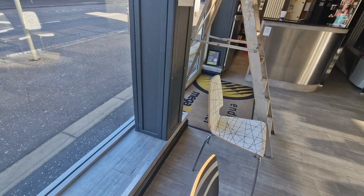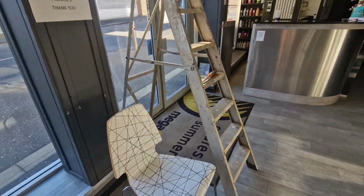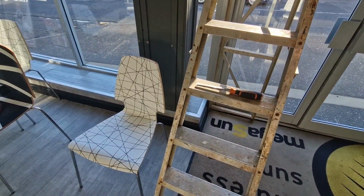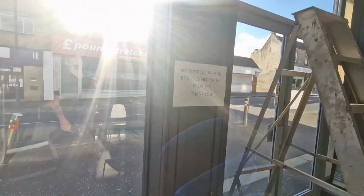Make it match. And I'll just put a pattress on there, and a double socket, that'll do it. Nothing fancy, just to give them power here for their hoover. Whether they want it that side, better this side. Even if I could have drilled through the pillar, I didn't really care what's in there. And I think a double socket there on a pattress with the trunking running up is good enough.